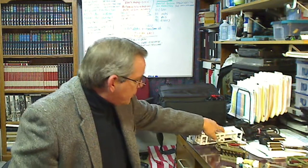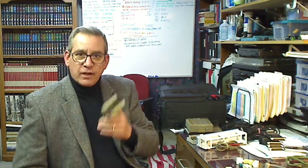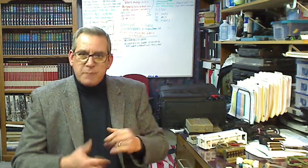As speeds became higher and we started looking at collision domains, bad connections started becoming a problem. In the phone company or Western Union — where I was a super tech — we really didn't have those problems. We had wire wraps and solder, industrial-strength jack panels we patched things in and out of, very beefy. When we get into the modular world with people just crimping things, all of a sudden you start having intermittent problems. This is why I really stress how important it is to have good quality control.